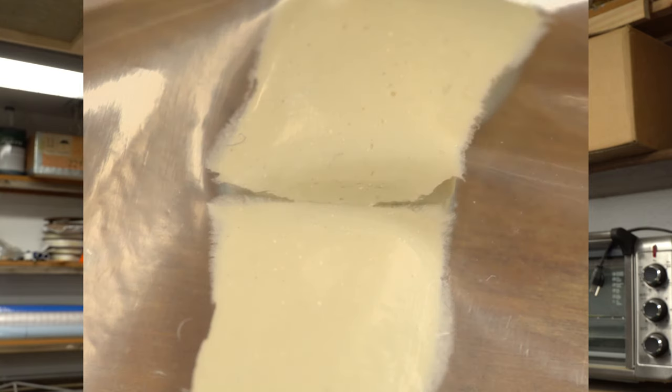If you need to release the vacuum after your initial test — for example, if you have a resin trap and also need to degas your epoxy and don't have a good way to clamp off the vacuum line — once you finish degassing and get back to pulling vacuum for resin infusion or a wet layup, go back and recheck all those crevices: the lap joints at the end of the top piece of tape and the 90-degree angles on your pleats. Re-press them if needed and check for any hairline leaks through those crevices.